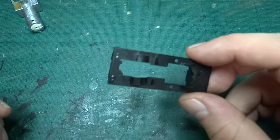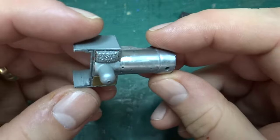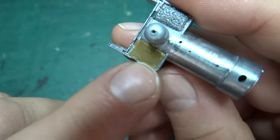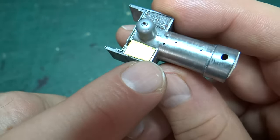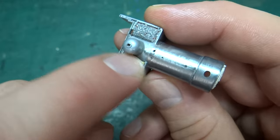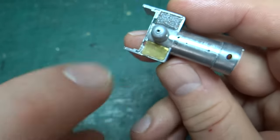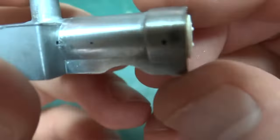Two holes didn't seem enough for a video, so I've found some time to do a bit more to the body casting. I've milled off the coal load and put a plate on the top to make it nice and smooth. Getting into the corners with the mill was difficult, so in the end I've done exactly what I did on the Talyllyn build, which was to plate it over once I'd milled out the coal. That will look fine when it's all painted up.